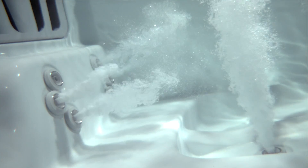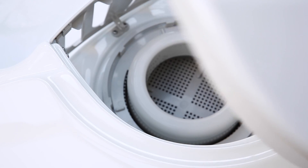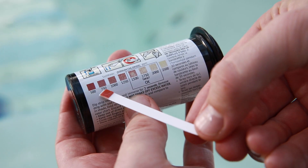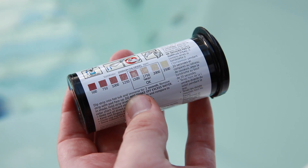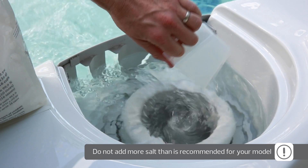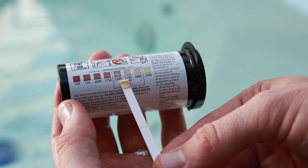Pairing the FreshWater Salt System with a silver cartridge is a great way to enhance your overall water quality. If you're using silver, you can insert it into the filter compartment now. Next, use the FreshWater salt test strips that came in your startup kit to measure the salt level. If there is less than 1,750 parts per million (ppm), repeat the same process, adding one cup of salt at a time until you reach 1,750 ppm. Be careful not to exceed the recommended amount of salt.